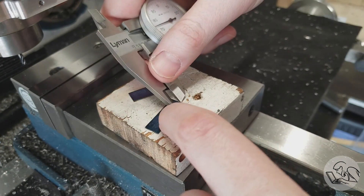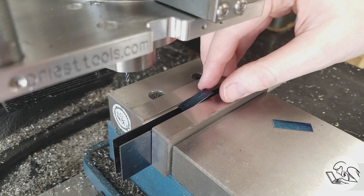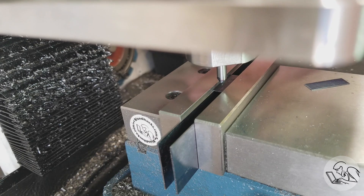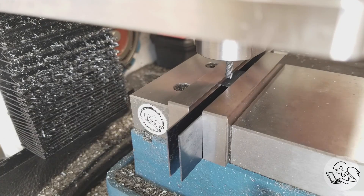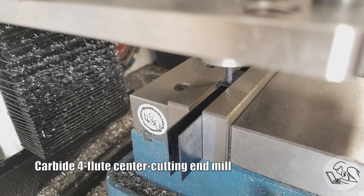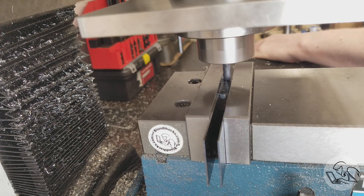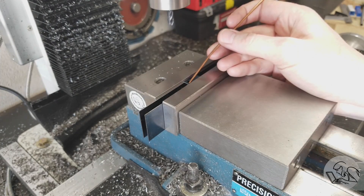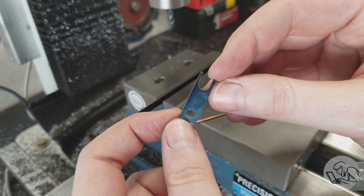I made two little blanks and now I'm laying out for the hole and the slot these parts need. I'm not going to center punch these — that would be hard on my center punch and might deform the thin material. Instead I'm using a sharp carbide chamfering tool, turning it by hand to make a little divot, and adjusting the table until that divot lands exactly on my layout lines. You can't really drill spring steel with high speed steel drills — Stefan's video covers a technique for it, but it chews up the drill. So instead I'm using a carbide four-flute end mill. Stefan mentioned a ball nose end mill is a great way to drill spring steel, but I didn't have one in the right size — the four-flute worked fine. For the slot at the other end, I'm milling in from the end with a nice slow feed and lots of speed. Looks very good — the slot is not quite on center, but it's certainly good enough.